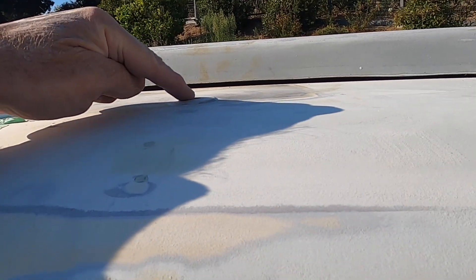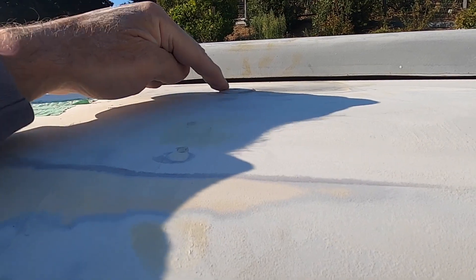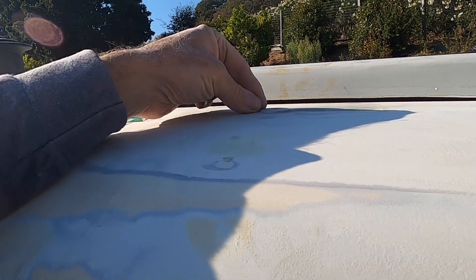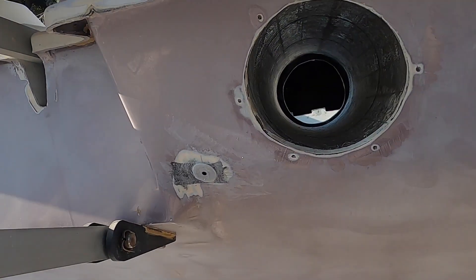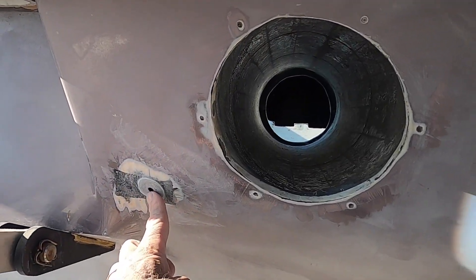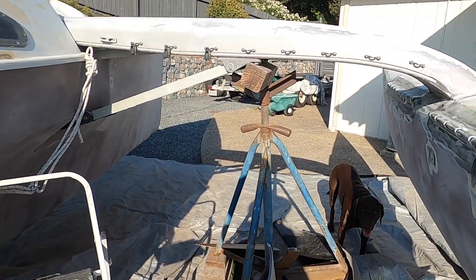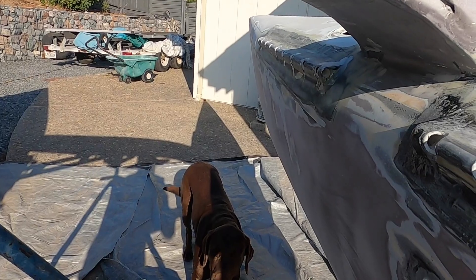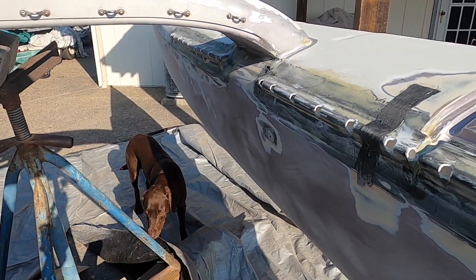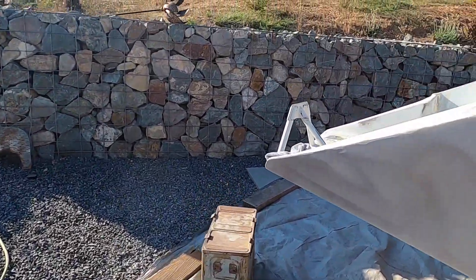Today I cut off the excess tube that was sticking up above the deck, both outside and inside. These are the landing bases for the soft pad eyes that are going to go here. Here's the emergency supplies hatch finished now. There's another pad eye anchor that goes from here over to here - these are the diagonal under-net strengthening lines. We'll do Dyneema instead of the wire I pulled out, in case the boat gets racked a little bit - to stop it from getting too torqued.